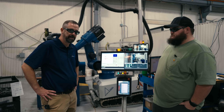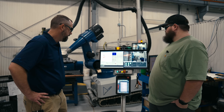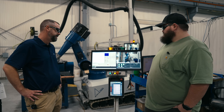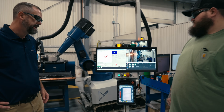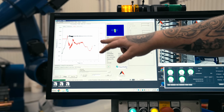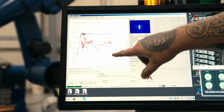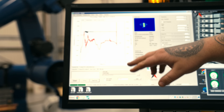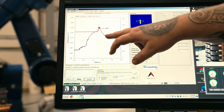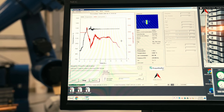The optical pyrometer allows us to have a consistent hardness depth. We're able to monitor that temperature in real time using the optical pyrometer, and that's what you can see here on this chart. The red line dictates your laser power and the black line dictates your total temperature. Our EMAC system on the AL Rock is going to do everything in its power to keep this black line as consistent as possible, leading to better consistency throughout the whole part.